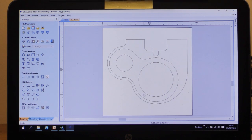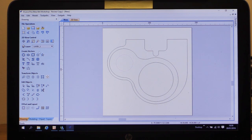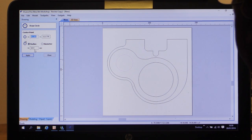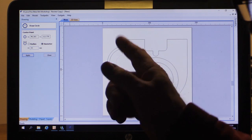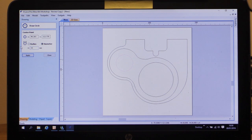I can look at the individual components. This circle has a radius of 37 millimetres. And this smaller circle has a radius of 18, a diameter of 36 millimetres. After I created it, I wished that was slightly smaller. So I'm going to change its diameter to 35. Note that this change has not been reflected in any of the files I've given away, so if you want 35 instead of 36 you'll need to make that change yourself. There — I've reduced that in size.